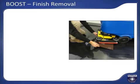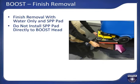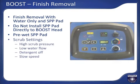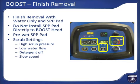Boost models of the CA-60 provide the ability to remove floor finish using just water in combination with a maroon surface preparation pad (SPP pad). Never install a maroon SPP pad directly to the boost face — use a new red or other daily scrubbing pad to protect the boost face as shown. Pre-wet the maroon pad and then lower the boost head with the red or other pad already installed on the boost face. For best finish removal results, the machine needs to be run with high down pressure and low solution flow with detergent off.